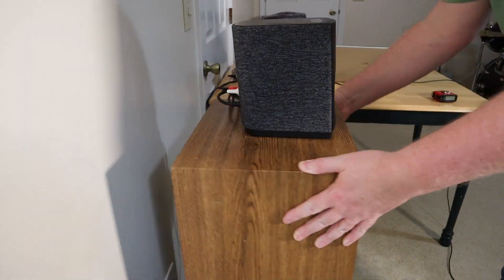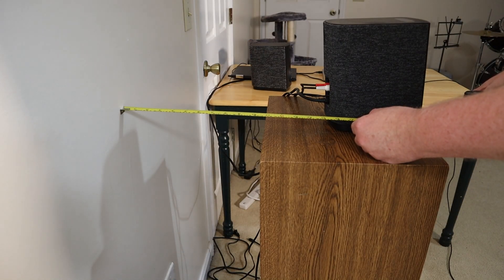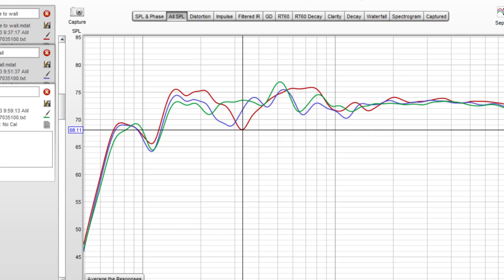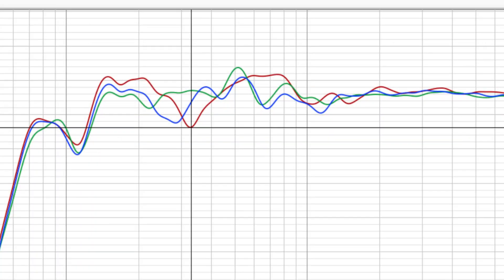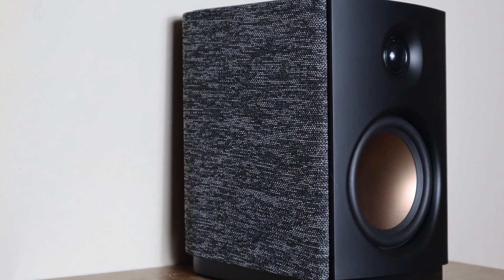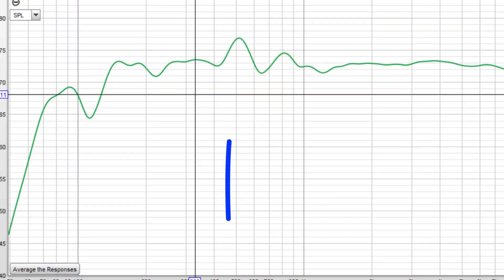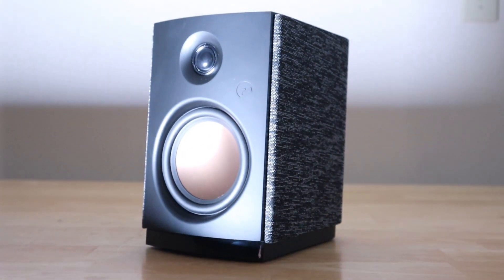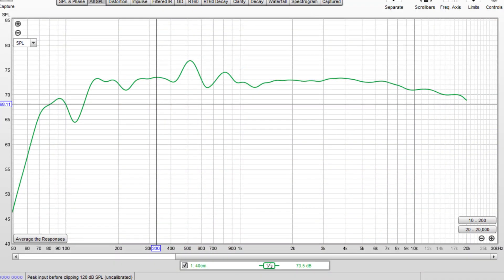Let's try the test again, this time moving the back of the speaker about 18 inches from the wall and sliding the microphone out a little further to compensate. You can see that the zone between 150 and 400 Hz has smoothed out quite a bit — the overall response in that region is much more linear, which is why you want to pull your speakers away from the wall. The null when the speaker was against the wall was likely caused by a reflection from the wall coming back to the microphone out of phase. The spike we now see is probably reflected sound arriving in phase, causing a standing wave — but in any case, pulling the speaker away from the wall gives you a much better result.